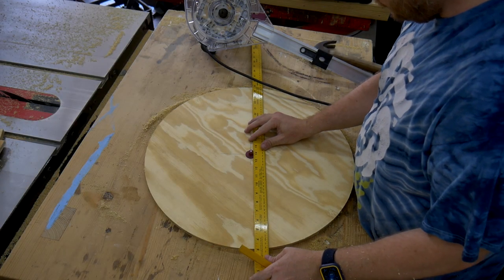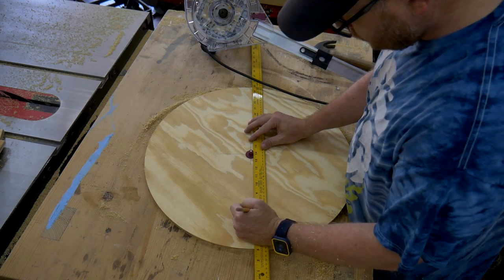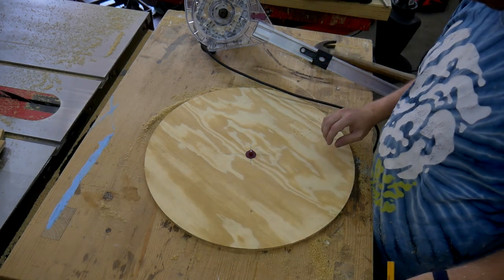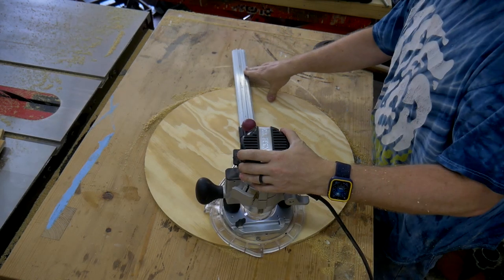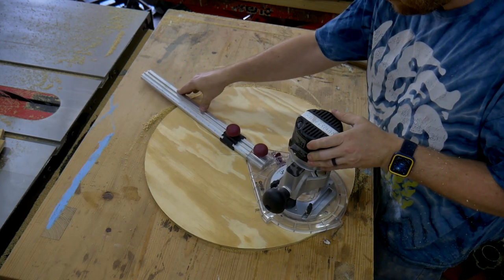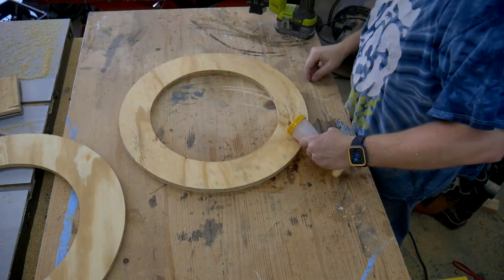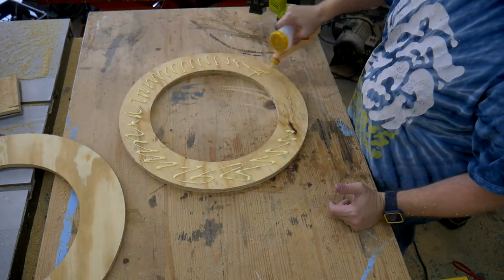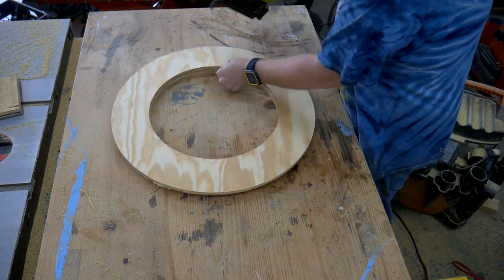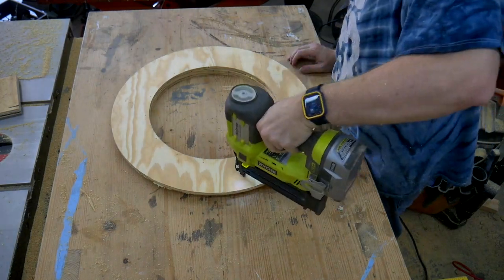My next challenge is to make a lid for the drum that will interface with the bottom of the Super Dust Deputy. I pull a scrap of plywood from my stash, square it up, cut it out to the same diameter as the drum, then cut a second circle on the inside — this is the recommended opening measurement provided by Oneida, the manufacturer of the Super Dust Deputy. I then repeated that process for a second ring that is the diameter of the inside of the drum. Once glued up to the top ring, this second ring both stiffens and reinforces the top, and also helps lock the lid into place securely on top of the drum.